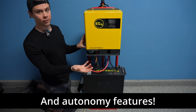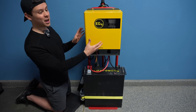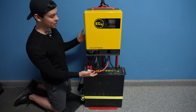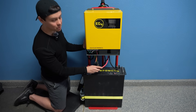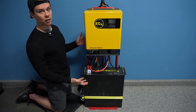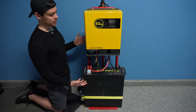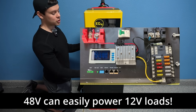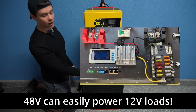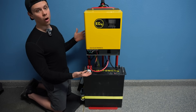If you have 240-volt loads like an EV charger, you can connect two of these units in parallel and then you'd have a 10,000-watt solar input. For the money, it's hard to beat 48 volts — they're easier to build and the cables are much cheaper than the 4-ought gauge you use with 12-volt. This system you can use in an RV or a van, and it's very easy to power 12-volt devices by adding a converter to this battery — just hook it right up because it has its own inline fuse. I have a tutorial video and a bunch of schematics on my website. If you want to build this instead of a 12-volt system, I'll have a link below.